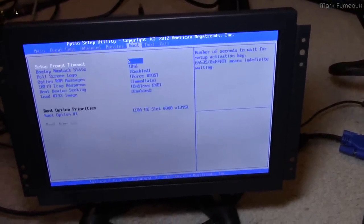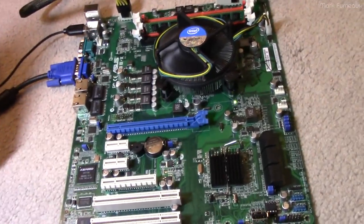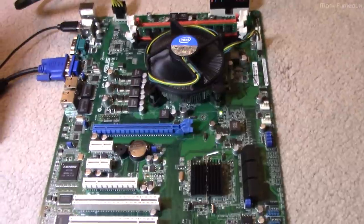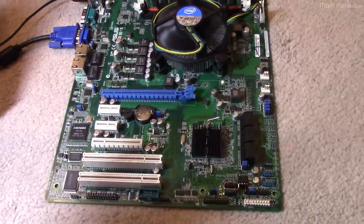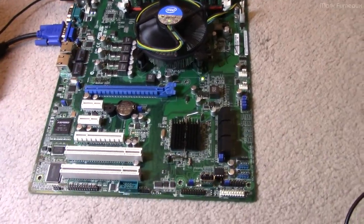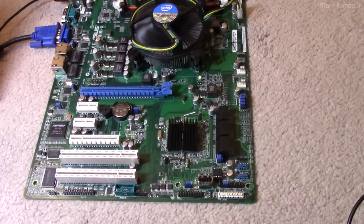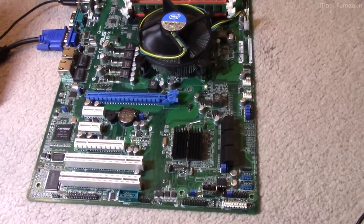I very much suspect it's going to boot into an OS and be okay. I think this board is fixed — I can scrub over the 'dead' sticker on there. The cause of death, as far as I can tell, was corruption in the BIOS code itself. Exactly how that got corrupted, I don't know. I'm going to boot up an OS and do some stress tests to verify everything is still okay. It could be that there was something physically wrong with the flash chip itself — the bits got corrupted, just bit rot or some kind of transient event.